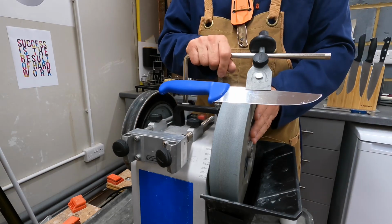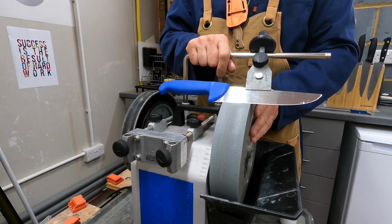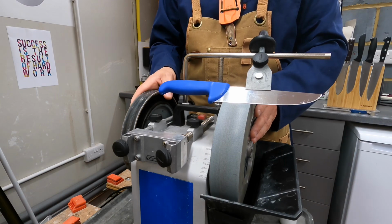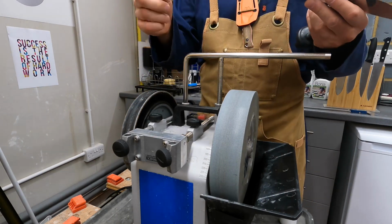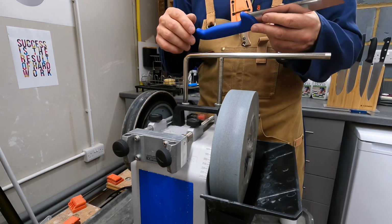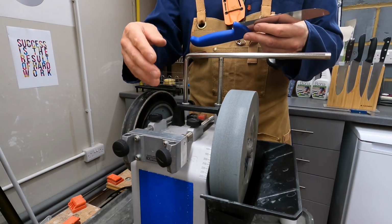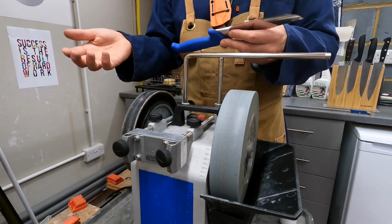And to have a great controlled angle solution for grinding here, you give away some of the advantage of that by having to hone freehand. And so the reason I choose as the first accessory that I would buy the FVB, or whatever name other suppliers put to it, is because you can then do proper guided honing as well and achieve amazing sharpness.